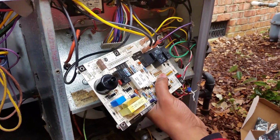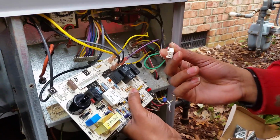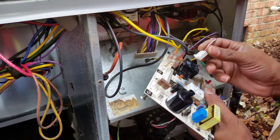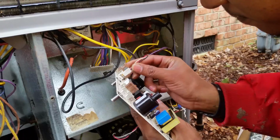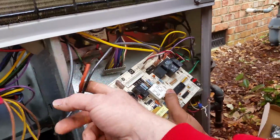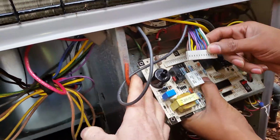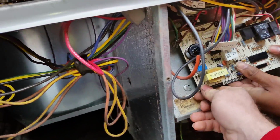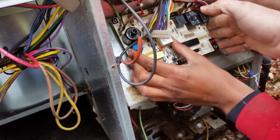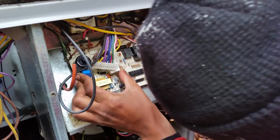And what's next? All right, that is the, what did we say that was? Centrifugal switch. Centrifugal switch. So you're going to put that on there. And then you're going to come over here for your commons and stuff, but your wires are going to start getting shorter now. So go ahead and put it in its place. Put all this up in there in its place. Make sure everything lines up. See, you've got that one missing. They've got these little tabs, you've got to come to the right. Yep, and then slide it over.